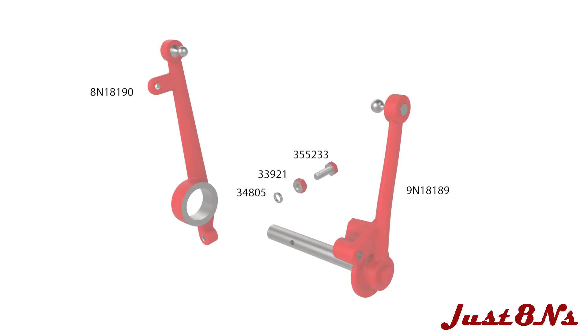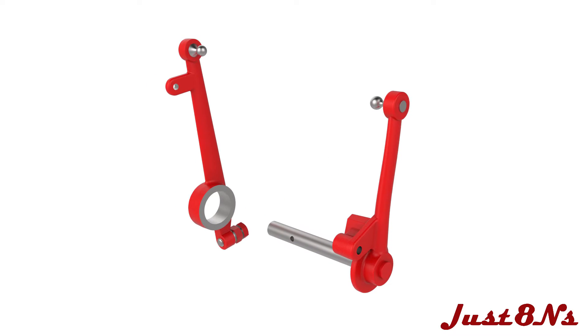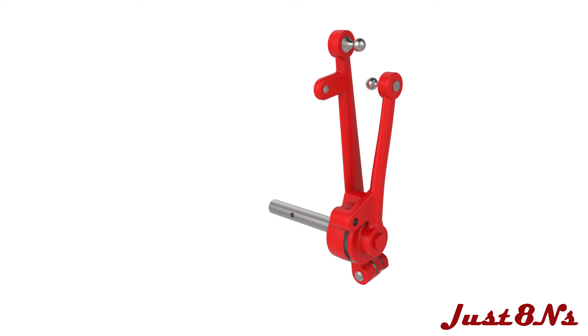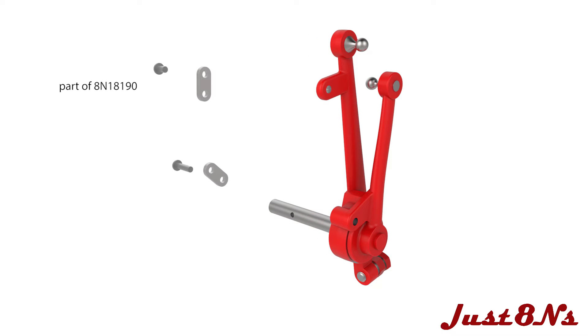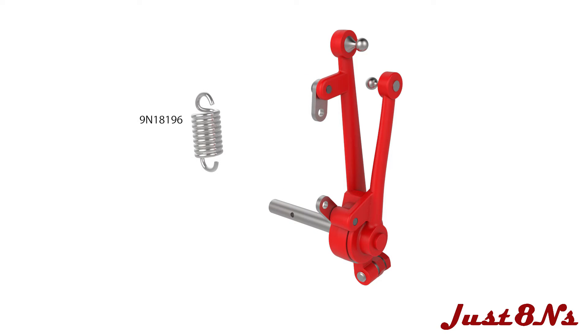Begin the assembly with the lever arms. Attach a bolt, nut, and washer to the inner lever arm and then mate with the outer lever arm. Attach the return spring connecting links with rivets to the mounting ears on each arm, then attach the spring to the links.